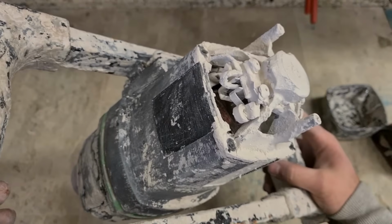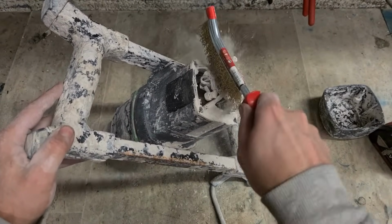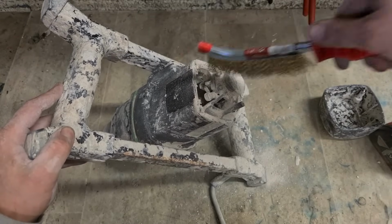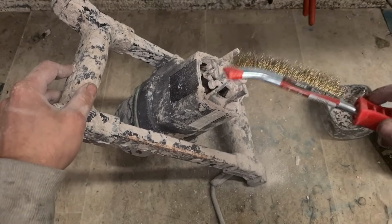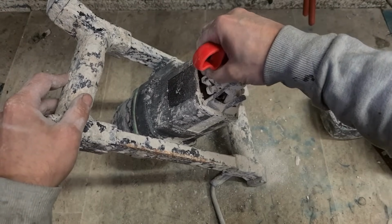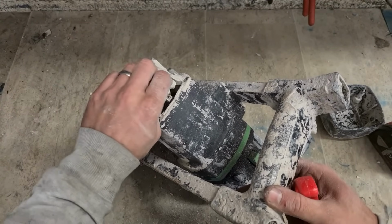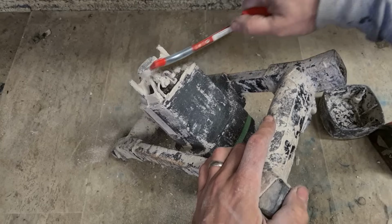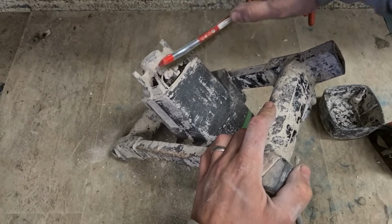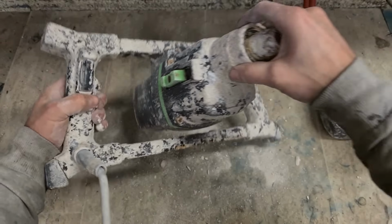That's your brush holder, completely caked. And it's like this here, it's only basically dust, but if that ever gets wet, that just turns to cement, jams everything solid, especially the brushes. May look bad there now, but the brushes can still move. It's only just dry dust. If she lays out in the rain someday, all that dust is going to harden, and that's when you get trouble. So that out to clean, and also get on here.